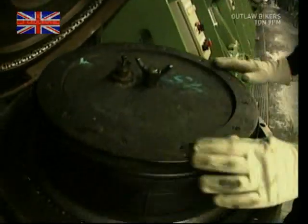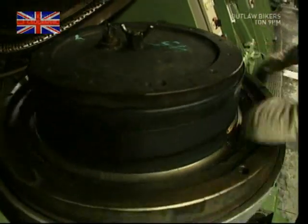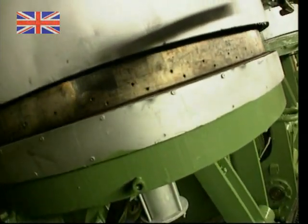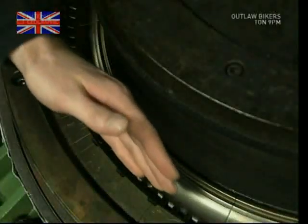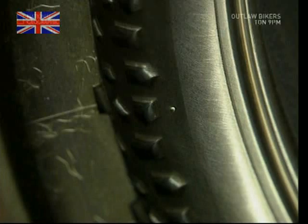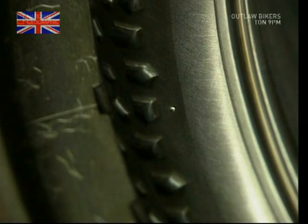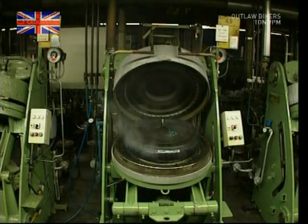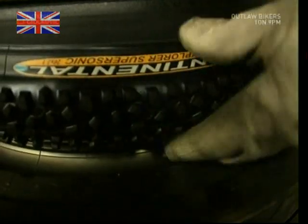This cooking process is known as vulcanization. The combined elements are loaded into a machine that heats them up to 180 degrees Celsius for three minutes. This melts everything together, and at the same time it expands the rubber into the treaded grooves. When the timer goes ping, the machine opens up, and the finished tire is removed.